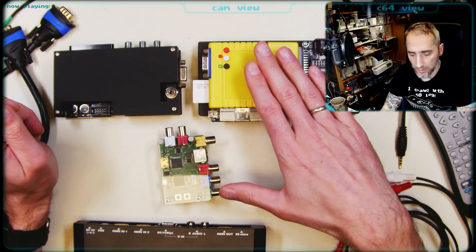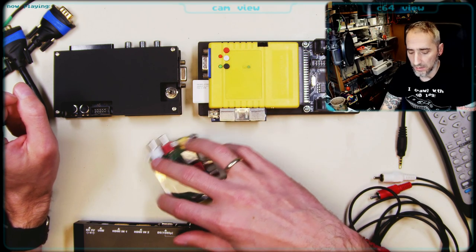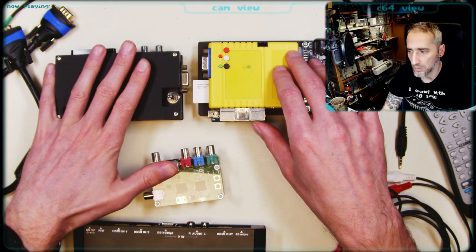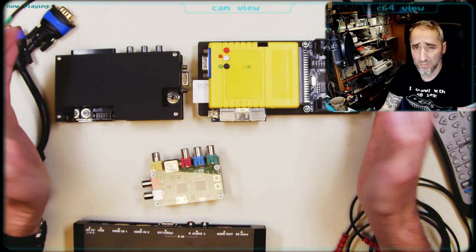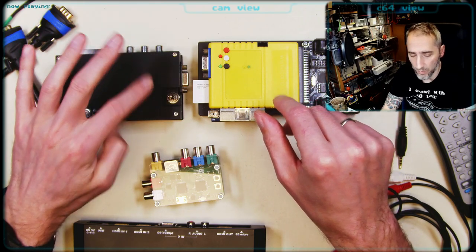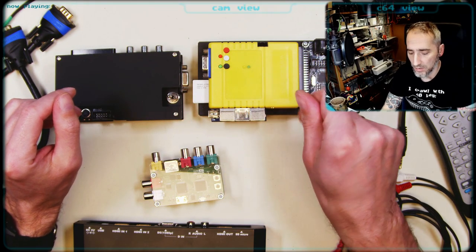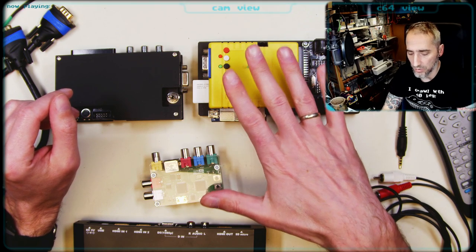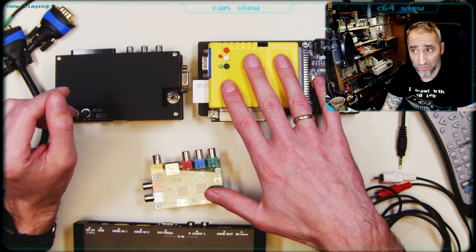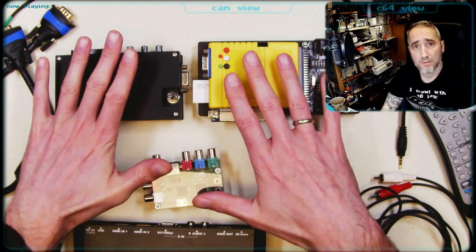And I'm still trying to get the 800x600 resolution to work, which would be perfect for most of the, let's say, Amiga cores or Amiga modes as well. But here the OSSC is providing a strange stretched signal. So that's something I have to check whether I can do some adjustments by those many features and functions the OSSC comes with. Or maybe if this needs to be addressed by firmware, if this is perhaps an issue of the Turbo Chameleon or something like this. As I said, I wasn't able to find a solution for this one. But that's on my agenda, because I found this a very nice combo.